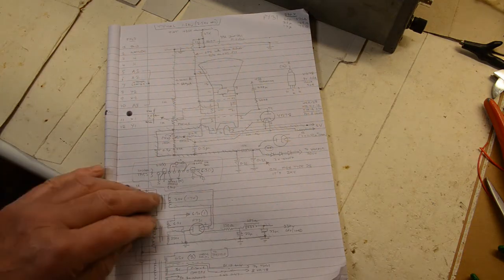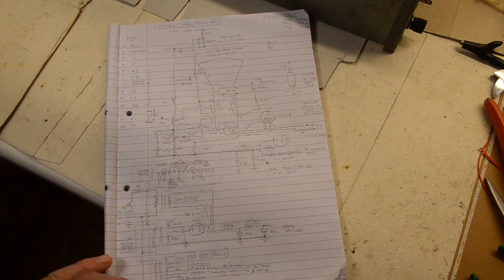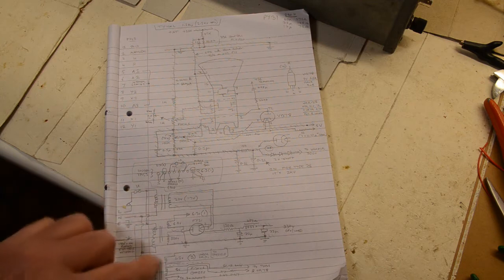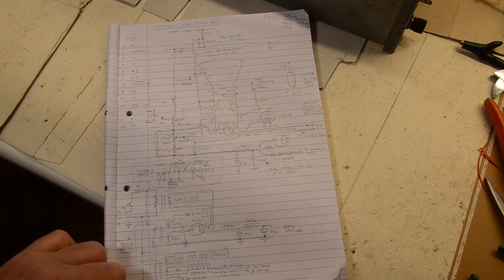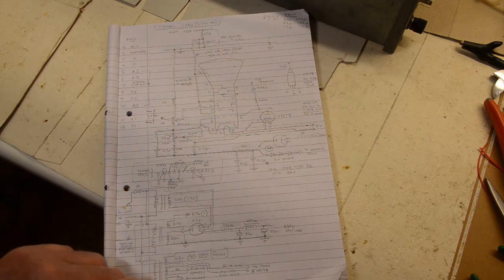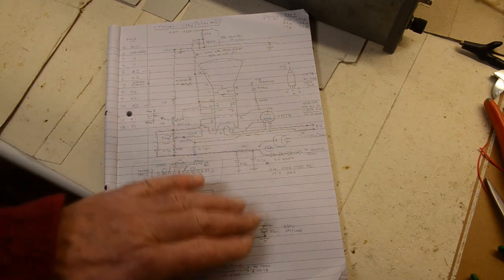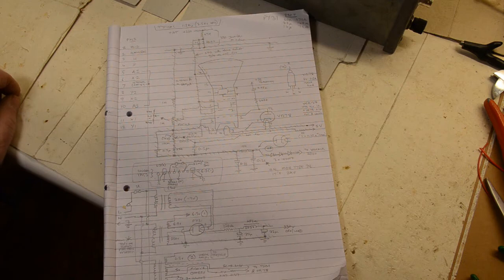So that's that. That's the 20 volts, there's the 250, and the 700 volts is in fact a 350 plus 350 volt mains transformer. So we've removed the center tap, we're not using that, taken one end down to earth, and we have 700 volts off load. And once we've rectified that, that takes it up to just under 1000 volts. So if we add the 1000 volts to the minimum of about 300 volts here, that takes us up to about 1200, 1300 volts for the tube, which is just what it's looking for.